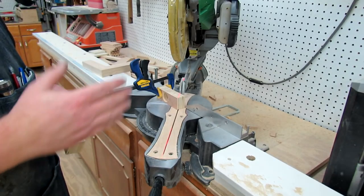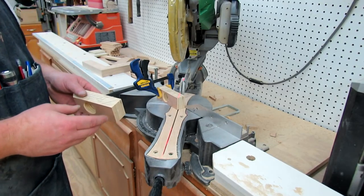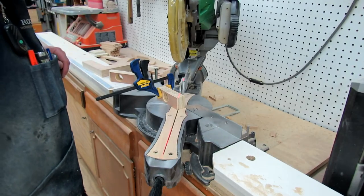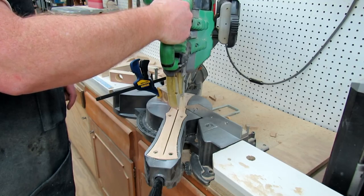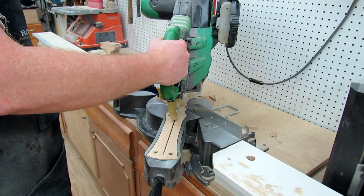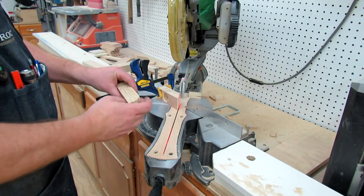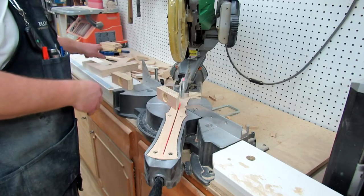Cut these smaller blocks — I'm going to use my miter saw. If you don't feel comfortable with that, you can always use a hand saw. All you need is to set your saw at 45 degrees. I'm using a clamp just to hold it to keep my hands away from it, and we're just going to come down with it. So that's how we do that — then the small portion you just flip it and cut it wherever you marked your line. All the cuts are 45 degrees wherever you marked your line.